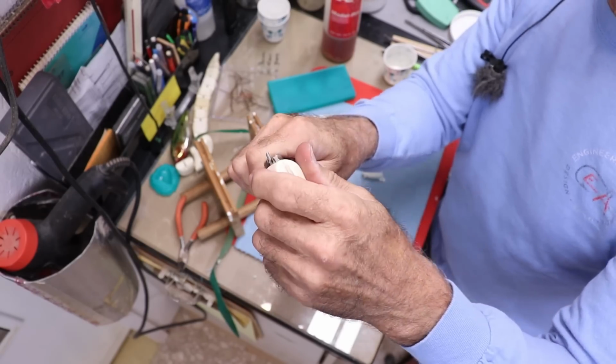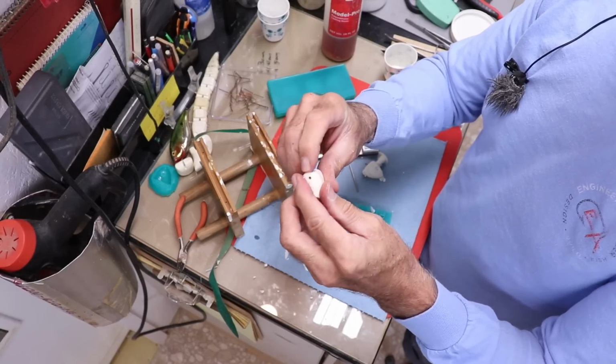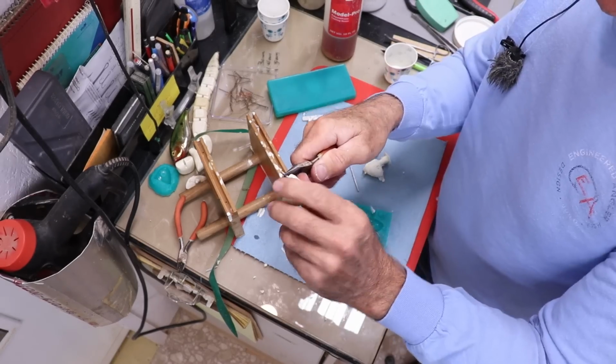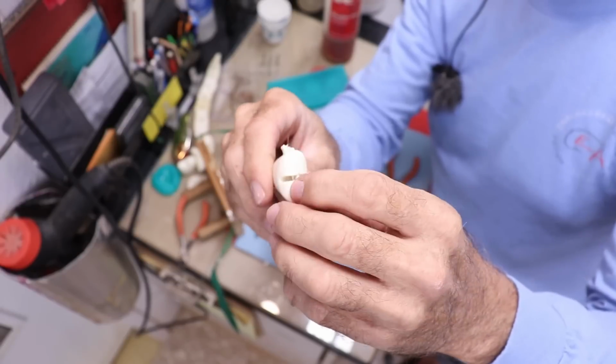I did coat them with Vaseline, so hopefully they're turning. Oh yeah, no problem. Sweet. And the casting is nice enough that I can almost clean it completely with my fingers. It looks pretty nice. Pull this pin out. Oh yeah. All right, and then the hardware that sticks out, it just gets cut off with a little Dremel tool. So there's a little work to be done.